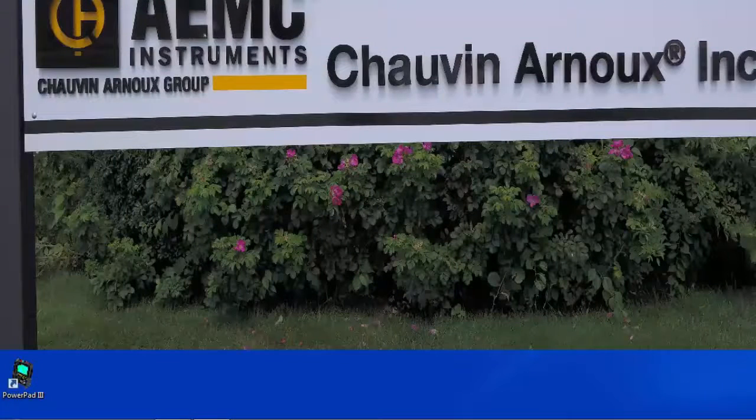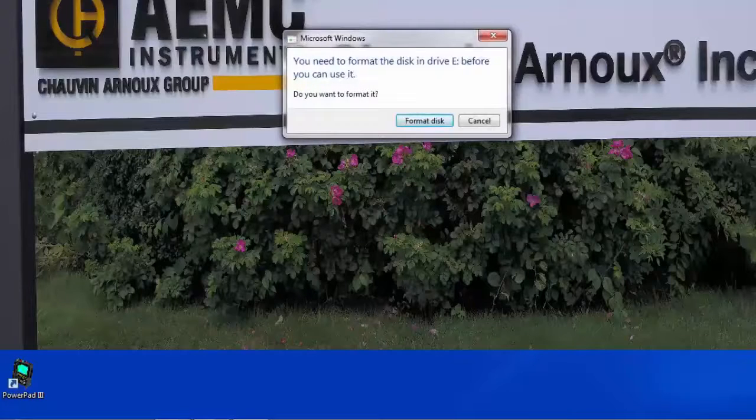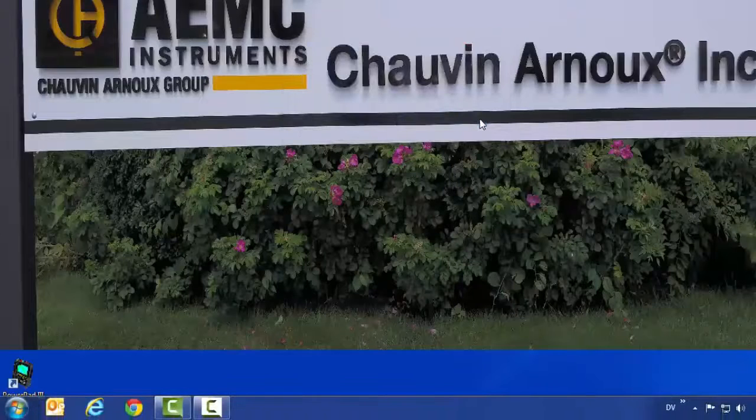Okay, I inserted the card in the card reader. And what pops up on the Windows screen is Microsoft Windows: You need to format the disk in Drive E before you can use it. Do you want to format it? The answer is definitely no. So definitely cancel. But try to remember the letter of the drive before you do that, though. So it's drive E, and I hit cancel now.